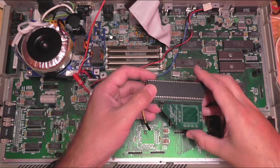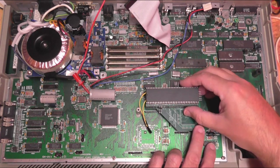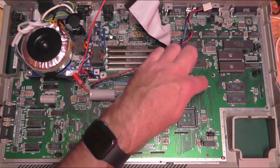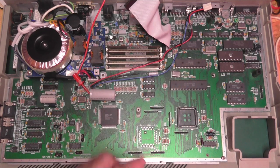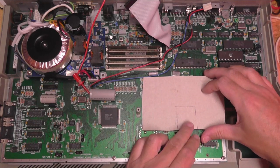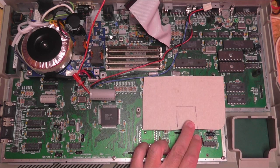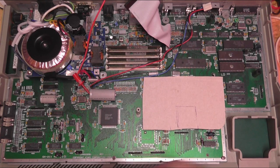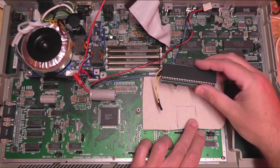You see there's the DST-B1 and that is quite a stack — even if you take off the debugging pins. Perhaps if we were to offset it a little bit further, move it back here, have it sit above the MFP chip there, that would perhaps be sufficient. I've sketched out a quick cut-out on a bit of cardboard which is where I think I have clearance. I suspect though, because of the way that the keyboard is configured, even if I were to go out to that extreme, the keyboard wouldn't fit with that thickness of stack.